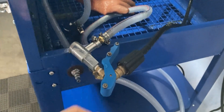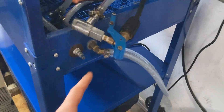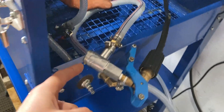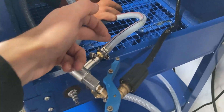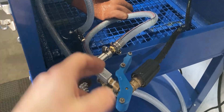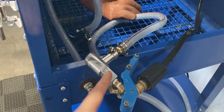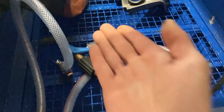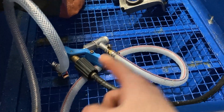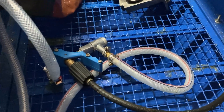I also have this custom-made gun. The pressure line comes right into here, and I also have the valve from the pressure washer that I removed — it was actually in the trigger — to make this custom gun. The other line feeding into the cabinet runs into this elbow, and through this clear hose we have water and media running into the front of this gun. So now if we have media and water coming through here, our pressurized water will shoot in from the back through an orifice, come out pressurized, and the media will blast up against the part.